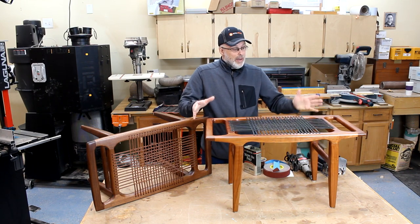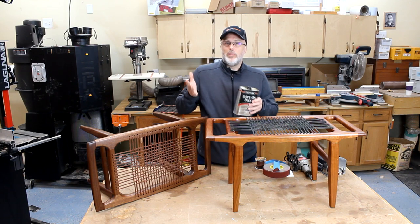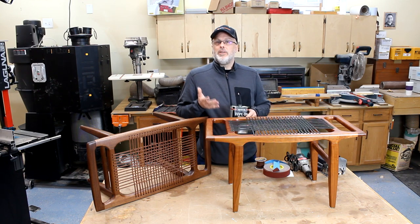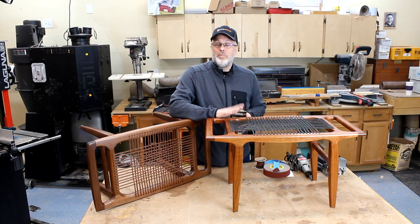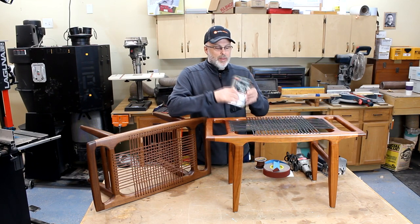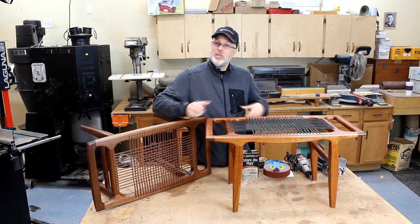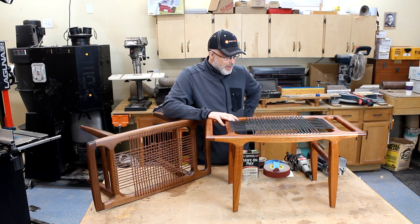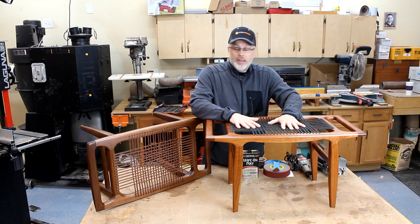After finish sanding and getting everything ready for finish, I used a wipe-on poly. There is an official Sam Maloof finish, which is a blend of a couple of different oils — nice stuff — but I don't feel it's very durable. In fact, the Maloof original chair I sat in was in bad need of being refinished. I used the polyurethane in the same wipe-on, wipe-off fashion that Maloof describes, putting about 10 coats on. It doesn't build up very much because you're wiping most of it off, but it gives a nice luster and hopefully a more durable finish than the Maloof original.